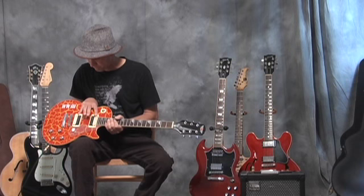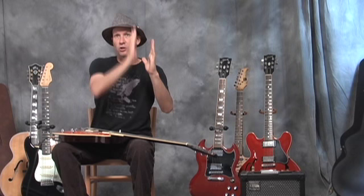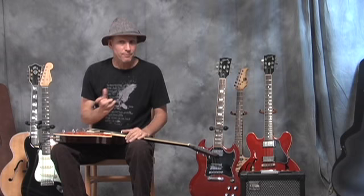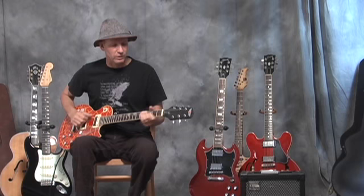When I say cheaper, the difference between a good pickup and one that's not so good — a balanced sound is really how we think of a good pickup. An inexpensive pickup on a guitar has spikes in the sound wave. If you were looking at a sound wave on a screen to see how the pickup is creating sound, an inexpensive pickup would have spikes, as opposed to a higher quality pickup which has a smoother curve. The reason that's significant is if you turn the volume way up on a less expensive guitar, those spikes in the sound wave are the first things that hit your ears. You're hearing certain frequencies a lot louder than the others, which throws the balance of the sound out, and you don't get a nice smooth guitar replication.